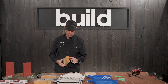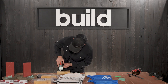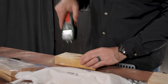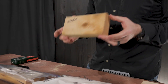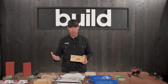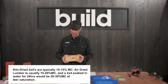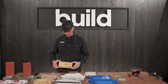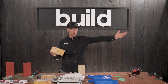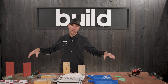You can just take one look at that and see that this end grain is saturated. It's been soaking — 28.2%. The fiber saturation point of wood is about 30%, so you would consider this soaked if it's between 26 and maybe 30%. So what I'm testing here on the Build Show is what happens to wood over time if it's left to dry naturally in the shade but outdoors, or if I've wrapped it in various types of house wrap.